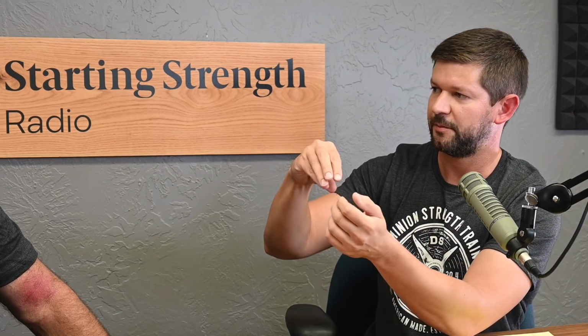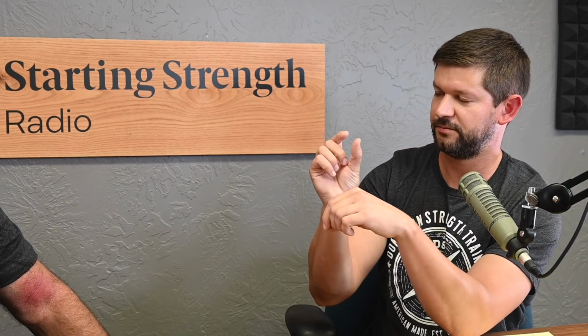when that piece that you're pulling through expands out, it pulls those two pieces of metal together, and then they can never come apart. Now, that doesn't really work for leather because metal is not going to deform when that tries to pull through, whereas leather can. So you just put a cap on top of that pop rivet, so when you pull it, it expands into the cap, and now you've got two pieces that are permanently joined together. And that's the two-piece mate rivet.